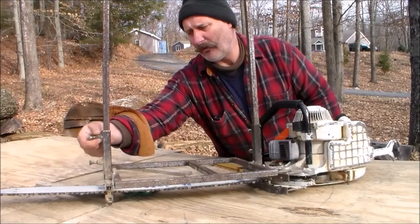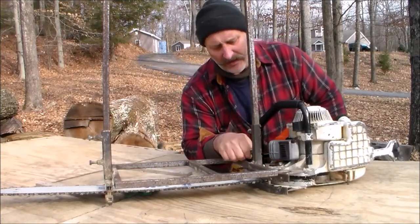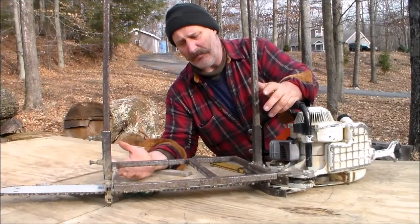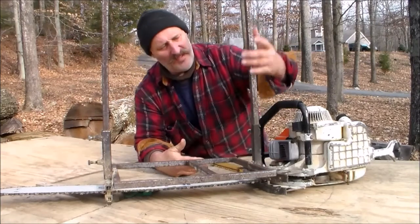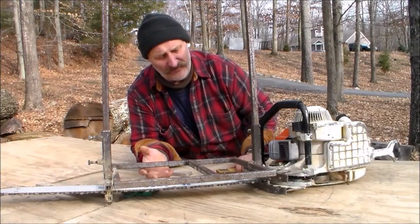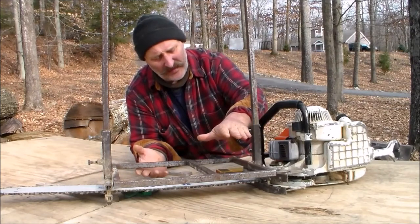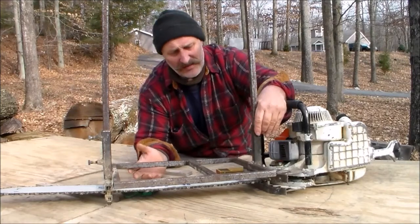There are just bolts where I welded two nuts onto each of these inline pieces of steel welded at a 90, and all that lets me do is clamp it down. It has no measuring increments or metering whatsoever — everything has to be measured. To do that I just use blocks of framing lumber at inch and a half, plus pieces of half-inch plywood to make up half inches. Put in a 2x4 flat and you've got an inch-and-a-half mill. Stack two pieces and you have three inches; turn it on edge for three and a half, add half-inch plywood for four inches. I block both sides at the same time.